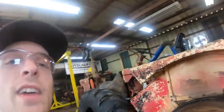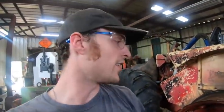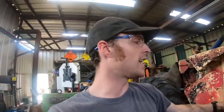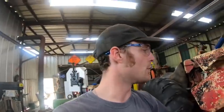Now, I will say, hindsight being 20/20, one thing I did not think of, evidently that's a fairly common problem. Evidently sometimes they just get stuck like that because someone else I watched on the internet doing this, he thought ahead, he had a crane truck, like a mechanic's crane truck with a hook that grabs onto that tire. And so what that does is it enables him when it's stuck like that, it will not move no matter what you do to it. He just grabs it with the hook and uses the crane to pull it this way, and it peels it off the rim.